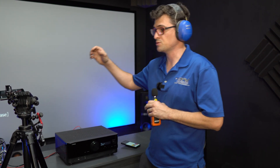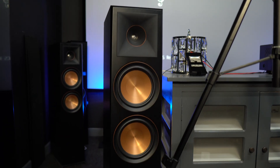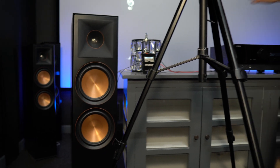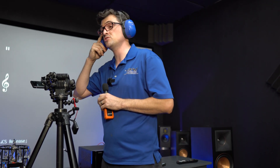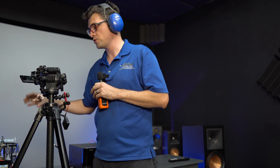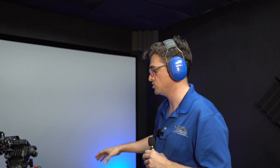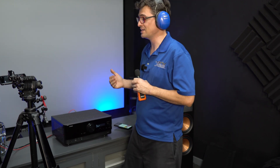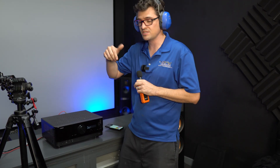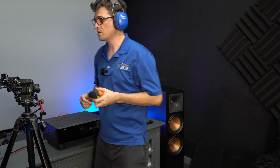Alright guys, so you saw what this was capable of with the 1000Hz sine wave. Now let's get into some real power — let's see the true potential of this with the full range. We're going to play an NCS song right now. This is a hard-hitting bass song, and this is a speaker that can handle the power. So we're going to push it really hard all the way up to reference at zero. As we turn up the volume, you're going to see the rating on the meter here change, and each time it sees a higher jump in wattage it's going to show us the peak real time. This is RMS wattage — the actual power this receiver can produce in two-channel stereo. Hearing protection on so we don't blow our eardrums out.